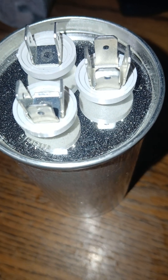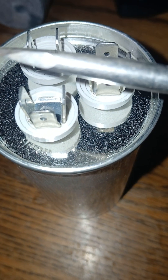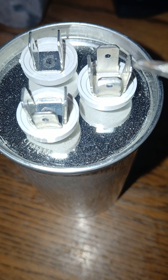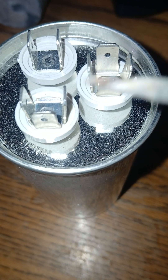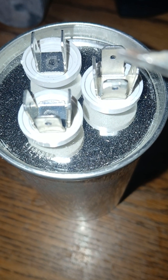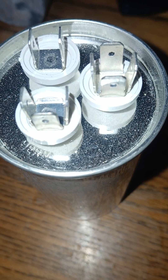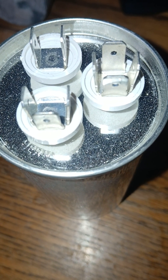This is a dual run capacitor, not a start capacitor. When you unplug these wires, it's good to take a picture of the wiring. Even better, understand the wiring concept so you know exactly which wire goes where. If you're the tenth technician in line, the wires may be jumbled up, so it's still good even if you're experienced to snap a picture or video and reference it later.